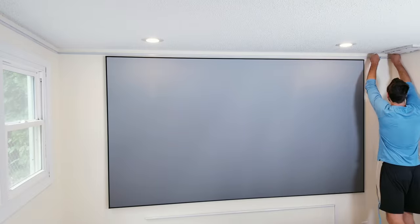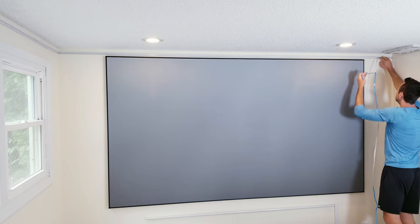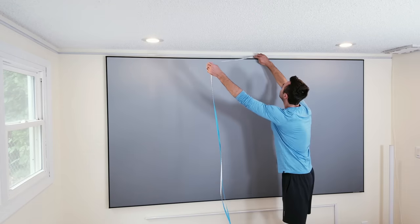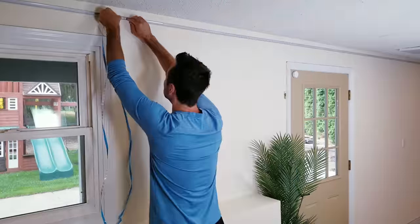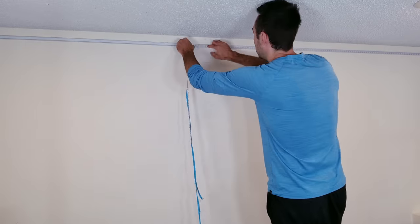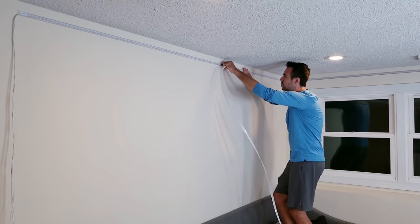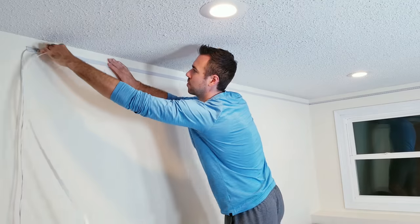Next I'll be installing the long LED strip we put together earlier. I'm starting at the end and working my way around toward the beginning, meaning the strip I'm attaching in this corner now is the part with only the two power injection wires. As I got to the end I had some leftover LED strip, so I added a couple more diffuser channels to the wall to use up the entire length. Once the strip is installed, I attach the long diffuser cover — at corners and ends, scissors were all I needed to cut it.